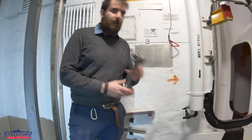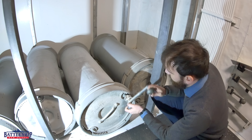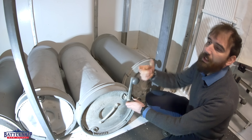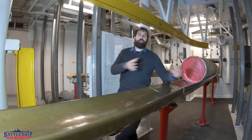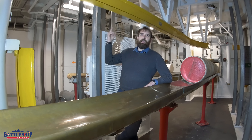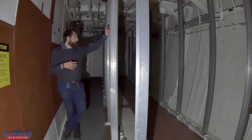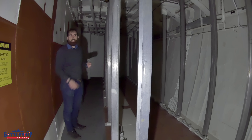Or we offload it the fun way. To do that, you take one of these cast aluminum knobs — this slots onto the door of the powder can and you turn it, which unlocks the door so you can reach in and get the powder out. In order to get more sailors pulling powder out, the magazines are two stories tall. Up here around turret one we have the side of the ship, so there's a lot less room, and so we get these multi-compartment powder magazines.